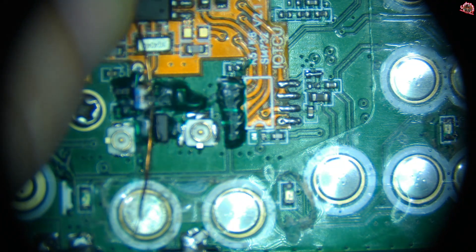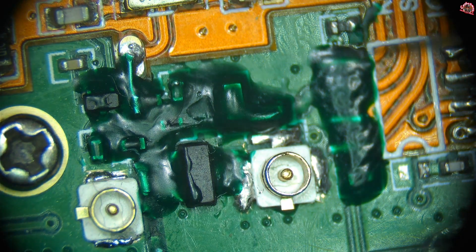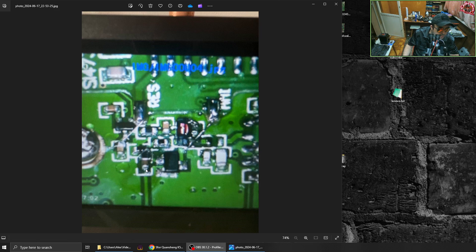They put it right on here — we have a coil or a capacitor here, probably a capacitor — and they put the choke like this. The antenna-in signal is taken from here and jumped right here. Looking back at the picture, here they have just a regular jumper. We make it here, but they make it to this capacitor. Nothing wrong with this — it's connected.